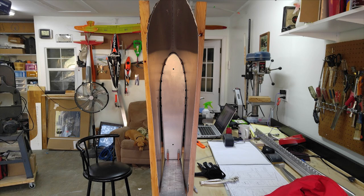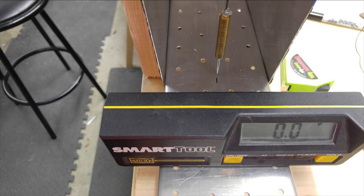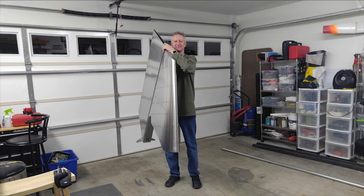Beyond that, the builder's manual from Zenith shows a somewhat fiddly way to fit the lower rib, but it's probably the best way. You basically pre-drill the holes in the rib flange but do not drill the holes in the skin, get everything true using a plumb bob and a level, then use a 90-degree angle drill and back-drill through the skin from the inside. You'll need a helper for that, but it worked out well and I think the fin turned out okay.